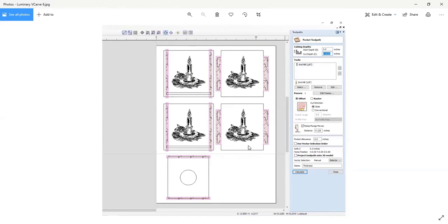The problem is, as we talked about, the plywood is never exactly 3/4 of an inch. And first of all, I rarely have the plywood in place when I'm programming to measure. And more importantly, I don't want to have to reprogram it every time I make a cabinet. So if I cut the dados to 11/16 of an inch wide instead of 3/4, and then I do a little rabbet cut on the edge of the deck or the stretchers, whatever's getting placed between the cabinet sides, and mill that down to 11/16 of an inch, my shelves or whatever will fit perfectly into the dados that we're creating, and I get to control everything that's going on without worrying about the actual thickness of the plywood. And that makes a huge difference.